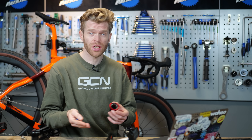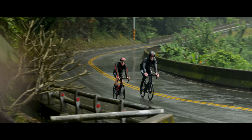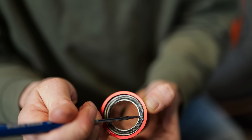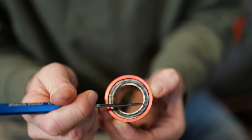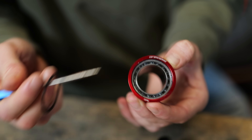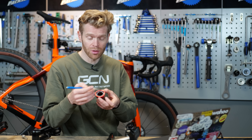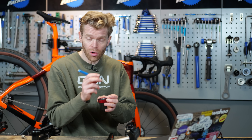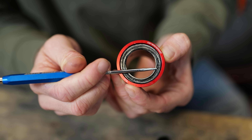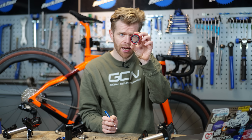The next one is water and dirt ingress into the bearing and general contamination. When water, dirt, and other contaminants get inside the bearing — they get past the bearing seal here, which I'm just going to remove. Dirt will cause increased friction within the bearing and wear as the balls spin within the cartridge, wearing both the balls and the cartridge itself. Water getting in there can change the chemistry of the grease, which is in there to act as a lubricant. With the seal removed, you can see the balls, the cage, and all the grease inside this bearing.